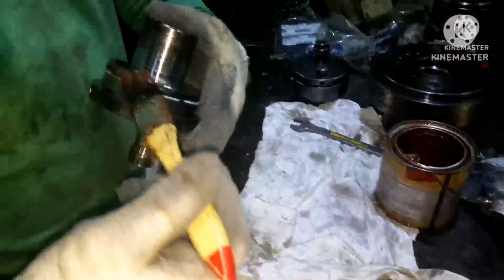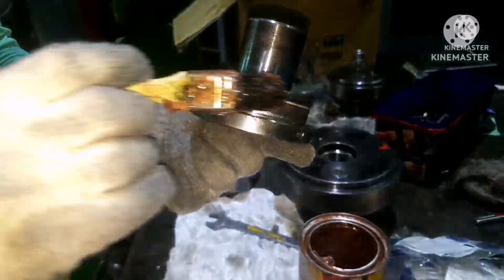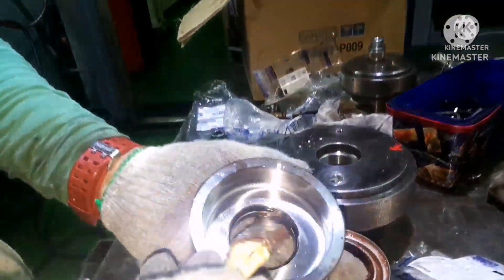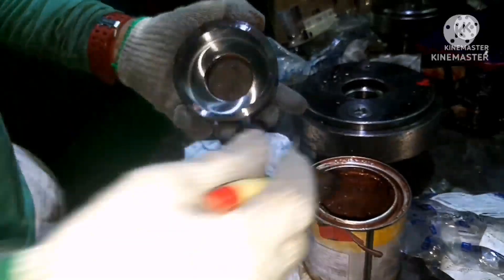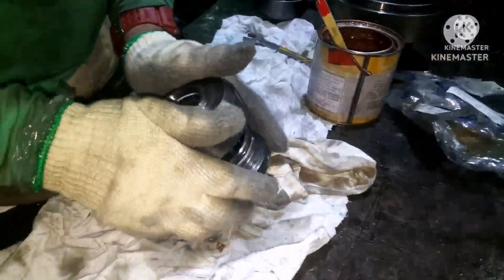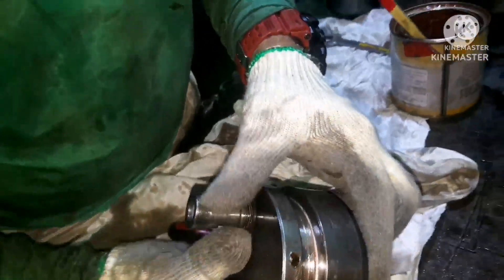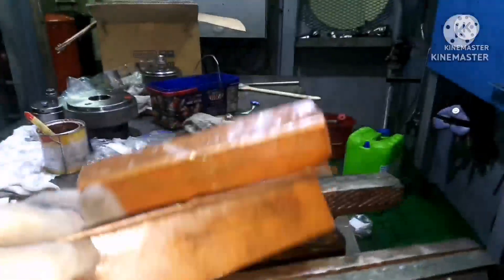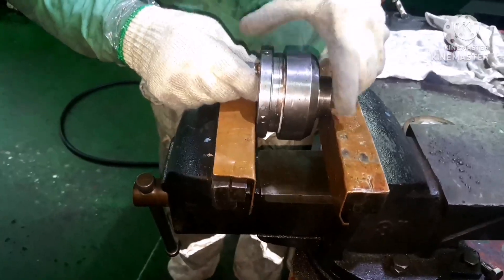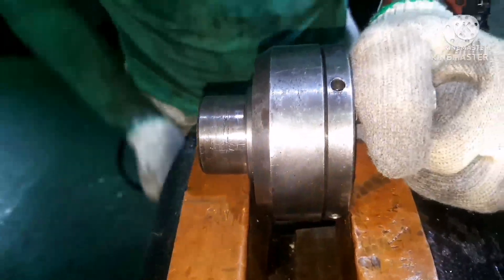Next, apply a coat of copper slip on the o-ring and backup ring area for both the piston and cylinder. Give a mild coat of copper slip, and do the same for the cylinder o-ring and backup ring. Then we need to fix both in place — we are going to assemble. It is very easy: just put the cylinder on top of the piston and press it mildly. The piston and cylinder should be pressed with equal pressure. Keep the hydraulic jack on the vice to achieve this.